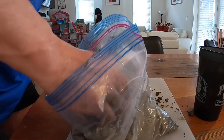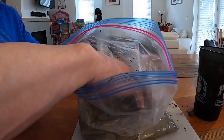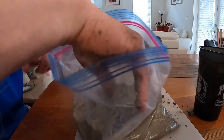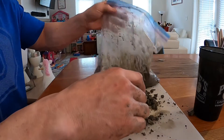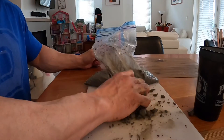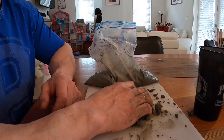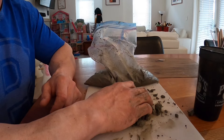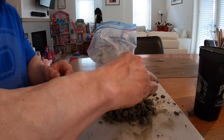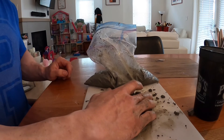That is the best and most effective way to kill concrete forever. I would almost venture to say that if you put enough sugar in the hopper - half a bag, it really doesn't take all that much - you could probably park the pump for the weekend, come in Monday morning, and still wash it out. I'm not going to recommend trying that, but that is how confident I am in this stuff. Get yourself a bag of brown or golden yellow sugar. The only thing I found with white sugar is it doesn't dissolve with water quite as quickly as the brown stuff does, making it harder to mix in uniformly. I recommend brown or yellow sugar - always keep a bag on the pump, great for emergencies, and it'll make for easier days over the course of your career.